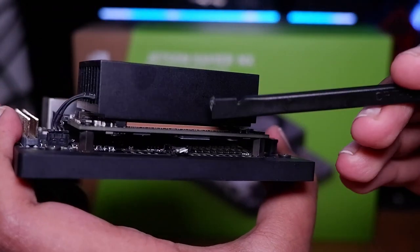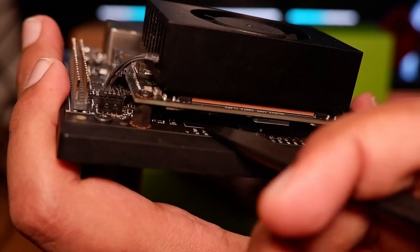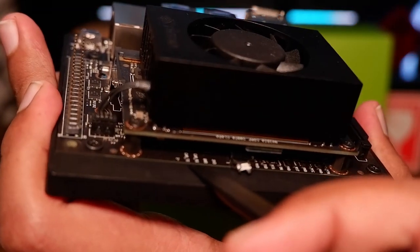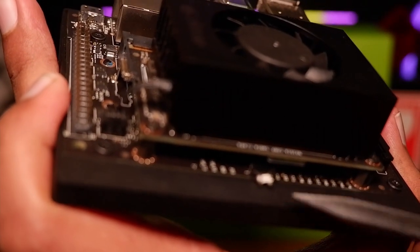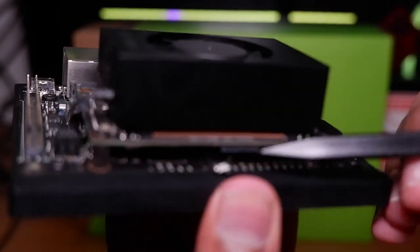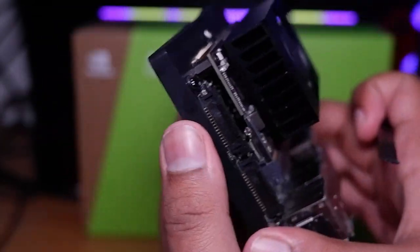On the SOM there are pins for interfacing with the power button and communication sections. There are also dedicated CAN bus connectors — great for my project since CAN bus can be integrated into automobiles, drones, or high-end controllers. I just need to solder headers to interface with it. There's also a tiny on-board LED indicator; I added a custom SMD LED externally since the built-in one isn't prominent enough to easily verify whether the board is in running or sleep state.